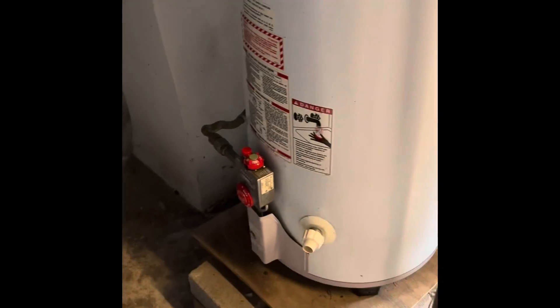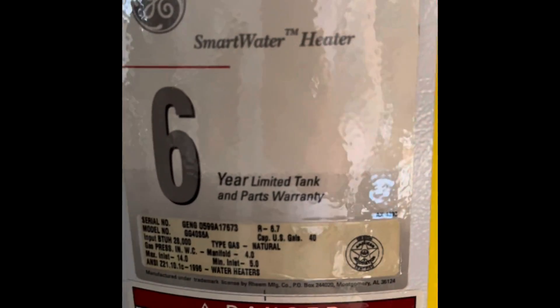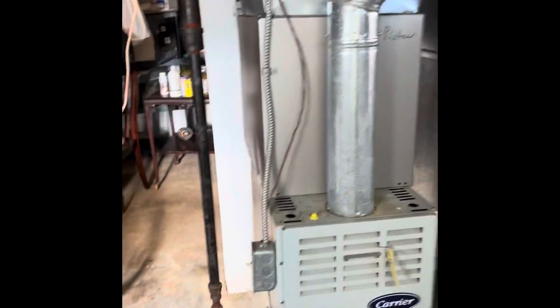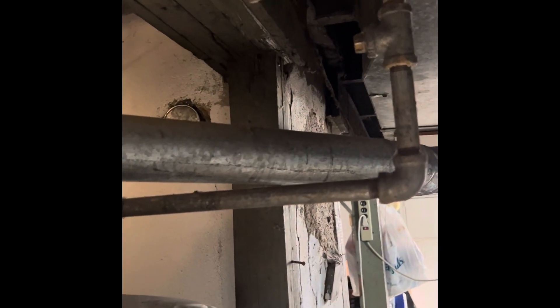The customer said the hot water heater had turned back on. She didn't have flood insurance, so she's probably not looking at a replacement right now. If it stops working, I'll get a picture of the model number and everything. We've got a 4-inch flue — we want to get that replaced. Probably sending out some 3-inch as well because it looks like our hot water tank might be on the borderline of passing from a permit standpoint.